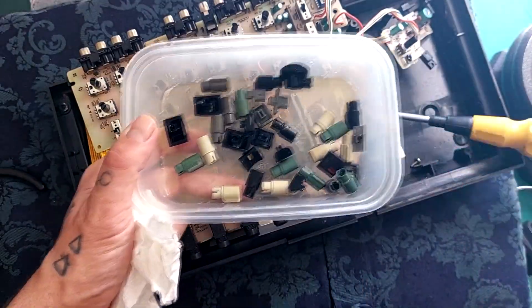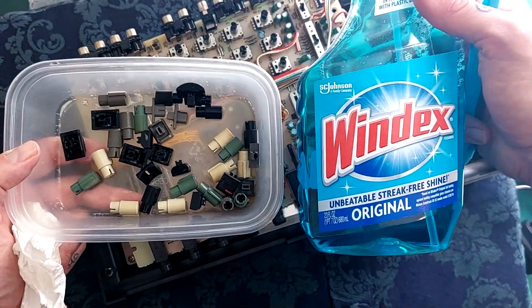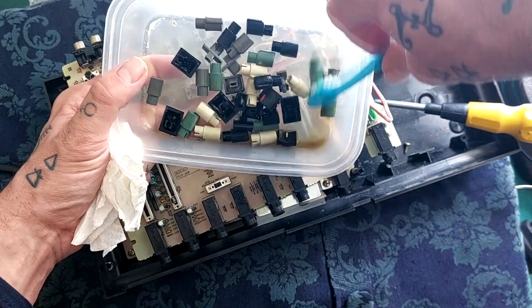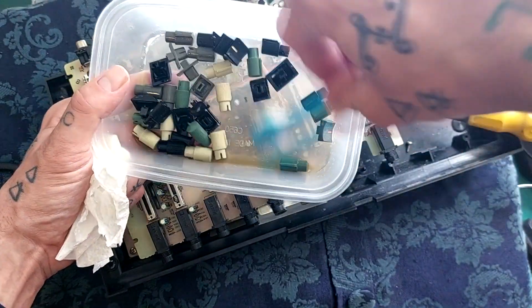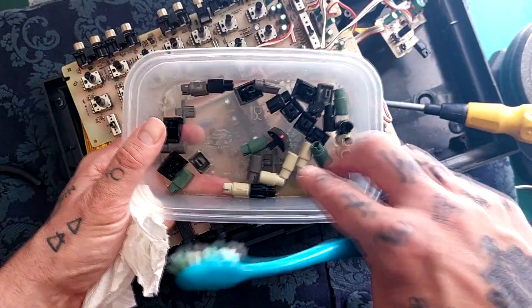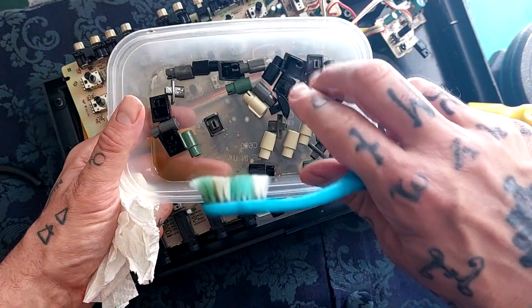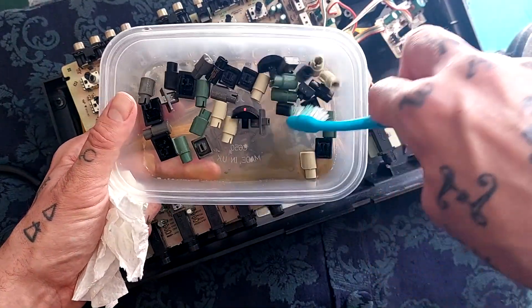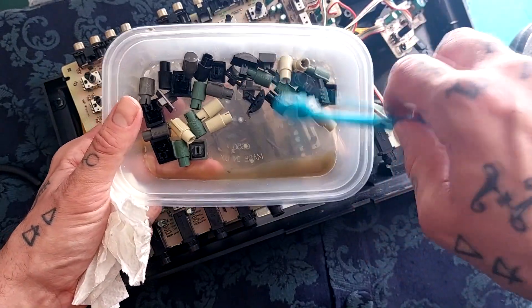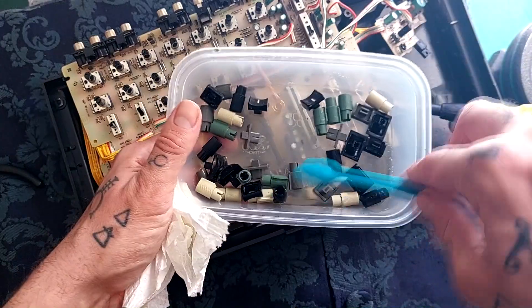For various plastic parts, I've got a little dish with some Windex on there - not necessarily easy to get hold of in the United Kingdom but I can order it from Amazon. On a tip from a viewer, that does seem to be the most effective for getting all the crud off, and you can see the Windex that's run off is pretty brown. There may be some discoloring on this plastic just from sunlight. I understand that putting some peroxide on there and leaving it in the sunlight can mitigate that - what's called retrobriting. I'm probably not going to go to that length as I'll be selling this on eventually.